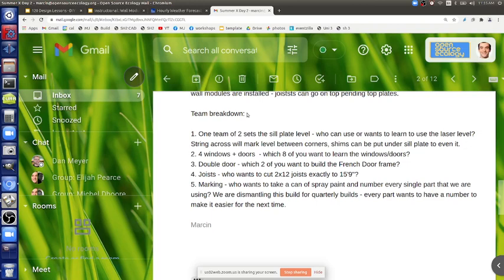So right now, what's acceptable? I would say 1 inch. If you say you got 1 inch difference from one side to the next, what's it going to end up in terms of tilt of your walls at 20 feet high? That's the critical thing. You don't want to be leaning over more than like 1 inch or half an inch. I would say maximum allowable would be up to 2 inch, because that would be the equivalent as if you had 2x4 framing, the rest of it is not doing anything.